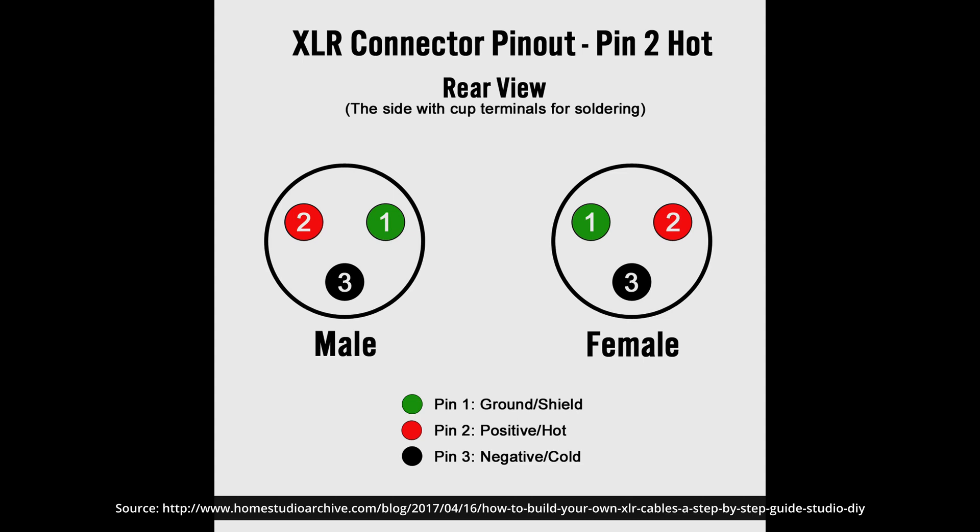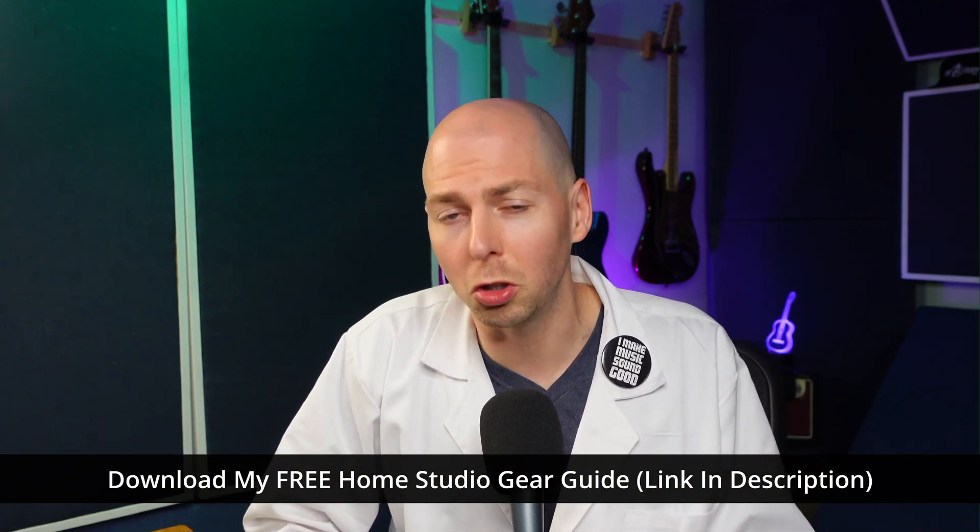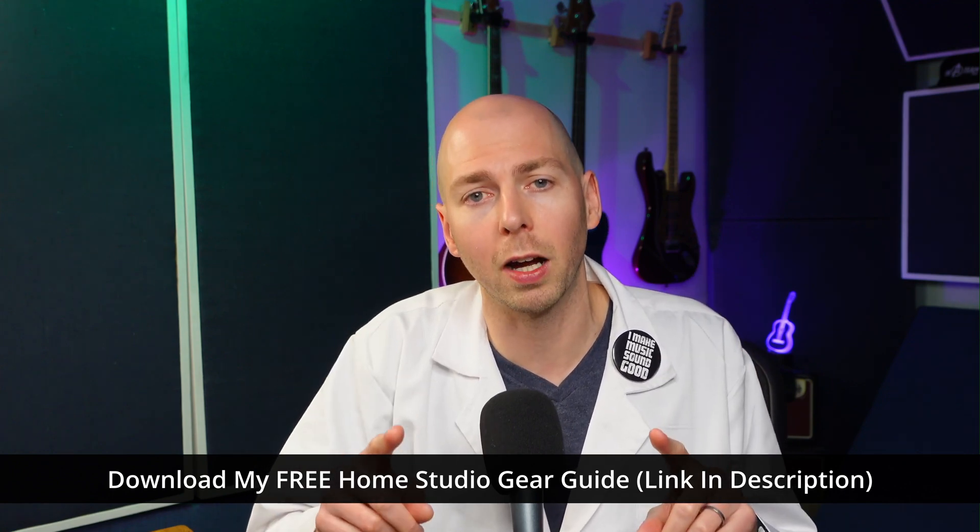If those other two conductors are switched, all it does is invert the polarity — it's not the end of the world and it won't degrade your signal quality. For quick reference: positive should go to pin 2 and negative to pin 3, or white to pin 2 and black to pin 3. Let me know what you think about this video, and if you have really expensive cables, let me know why you bought them in the comments — can you hear a difference? Is it because they're more robust? If you want my personal recommendation for the best value studio gear, check out the description and download my free studio gear guide. Please share this video if you think others will find it helpful. Thank you so much for your time and I hope I save you a few bucks buying your next set of cables.